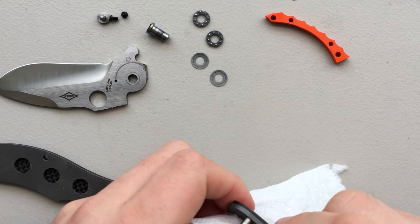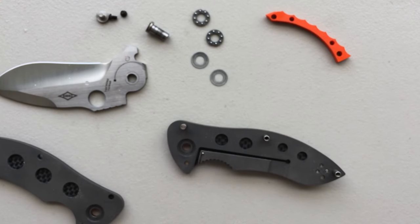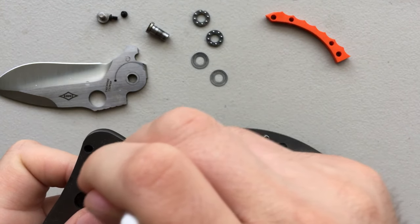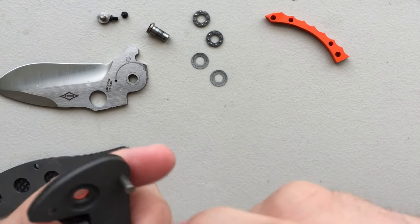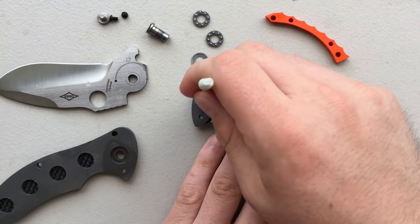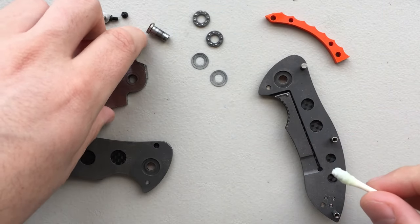Not the end of the world, but it's not gonna make for the best action either. It's interesting that they're using a bearing race at all here, because most of the time on a titanium-based flipper knife — I'm hitting a Q-tip with a little bit of Simple Green to do some of the rest of the cleanup — most of the time on a titanium knife, you tend to just run the bearings against the titanium and there's no smoothness penalty for doing that. That's what the Grimsmos are doing, and ZT — most of their flippers are running the bearings right on the titanium. The fact that they elected to use those spacers is interesting — it's just different; it adds a little bit of complexity.